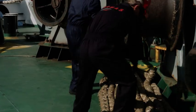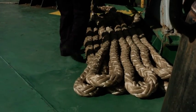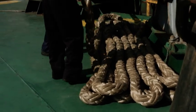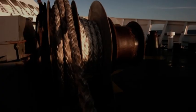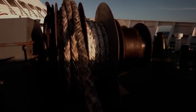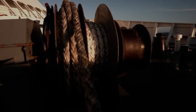Before use, a rope should be removed from a storage reel, because it is not designed to turn at the high speed experienced when the rope pays out, and it may not have a brake system that enables it to be controlled. Some ropes are designed to be left on storage drums whilst being deployed, as the drum is powered and used to both haul and store the rope. Split drum winches have a hauling or traction drum attached to a motor, as well as a storage drum alongside to hold the spare rope, and are designed for the rope to be left on whilst it is being worked.